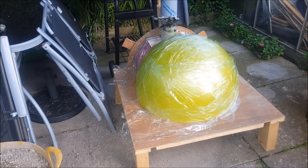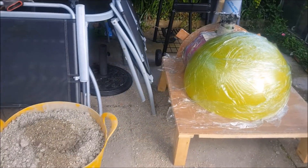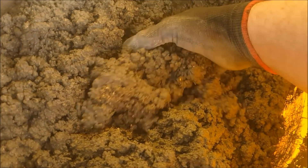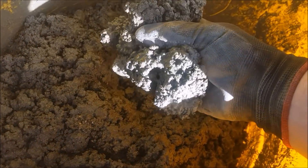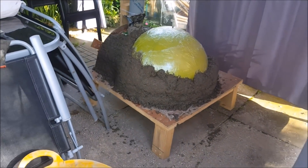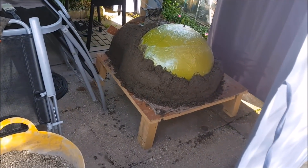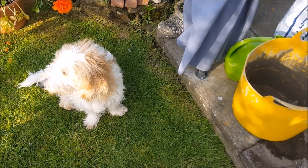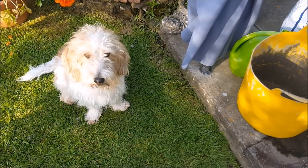This is the mix we've used again: three to one ratio, mixed with plenty of water, and I've put more cling film on to stop it sticking. That's the consistency we want — like a clay you can form in your hands. Dab it all onto the base, build it all up again, get the ring going around the bottom and fill it all up. Now that we're getting halfway up, you can see the pizza oven is starting to take shape. Paddington the apprentice has been helping out.